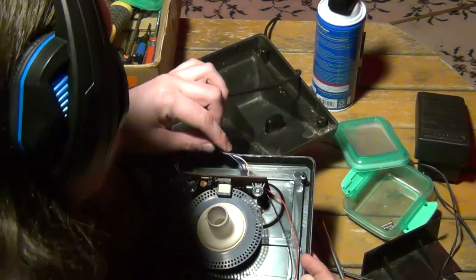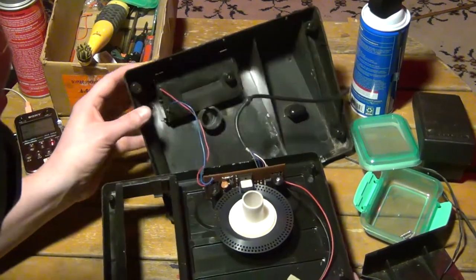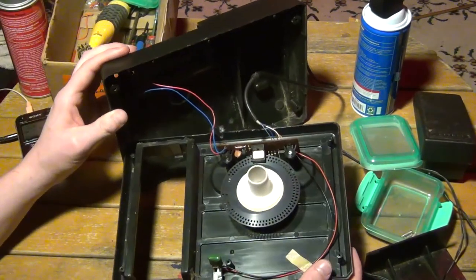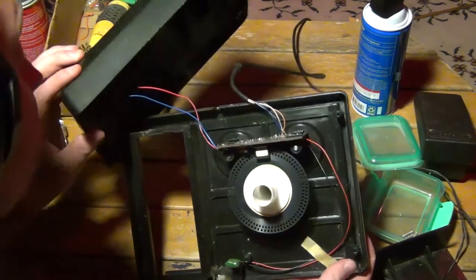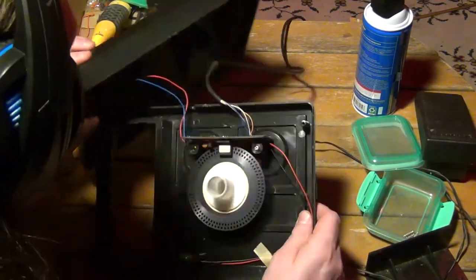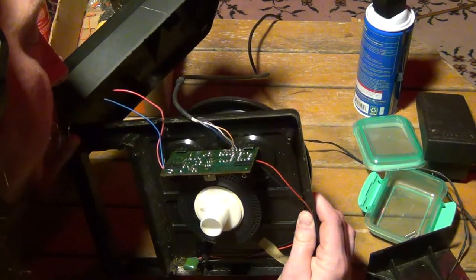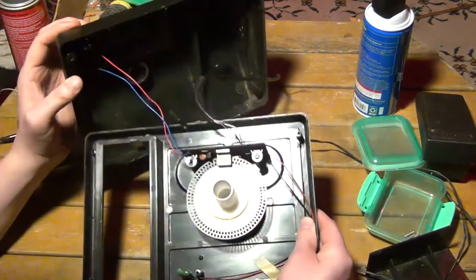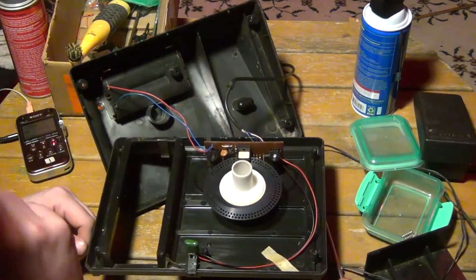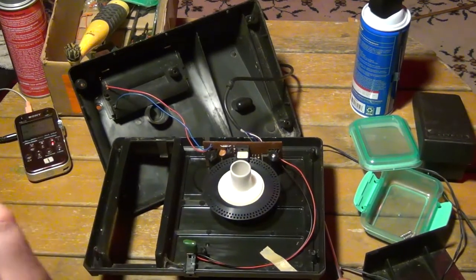This must be the magnetic wheel that works with the actual game, and I think this was the part that was screwing up, because when I flipped it upside down it was acting like it was making a connection and actually working. Everything is tied in here, so in order to do this I would just have to unsolder that. I just have to know that blue goes at the top and red goes on the bottom. Red's positive and blue is negative, and I just got to make sure not to connect the traces together. So I'm going to get my soldering iron set up and unsolder that so it will make it a lot easier for me to work with.